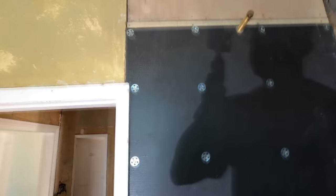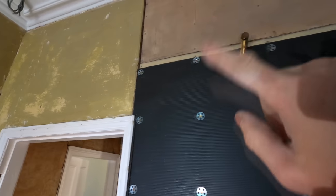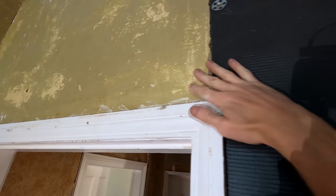Some of the original plaster on this. This is the original stud wall with the lime plaster on. So that's there. So we've managed to maintain this. What it did mean is, to marry through with this plaster over here, we've had to put some 18mm ply in first and then our 12mm elements board on top. And that's brought us through nicely with the existing plaster.